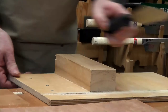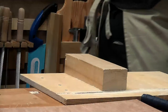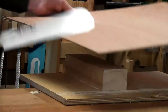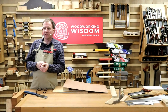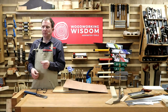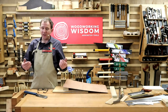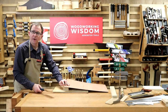One other thing, and I thought I might have had as a question. This is a bit coarse. The teeth on the front are quite coarse. Do they splinter plywood? We've all done that scenario, haven't you, where you want to cut a sheet of plywood and get lots of breakout underneath. Nothing more annoying. As with any saw, it's going to depend on how coarse the teeth are. Also, the cutting action can be a part of that. If you're cutting dead square on it, you're going to bust out the back. Or in this case, you're coming that way, you could splinter it. For me to do this, I'd actually probably draw my line on. I might even start right down where I am now. Right here.